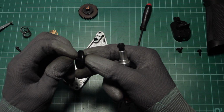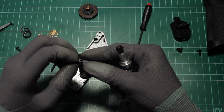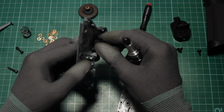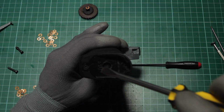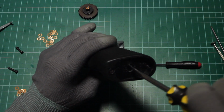Since both sides of the gears must be shimmed, I went ahead and backed out the motor enough so I could use a 0.1mm shim on the top of the bevel gear, which was the thinnest shim I had on hand. I then adjusted the motor height for maximum contact, while trying to avoid crushing the shim with the bevel gear.